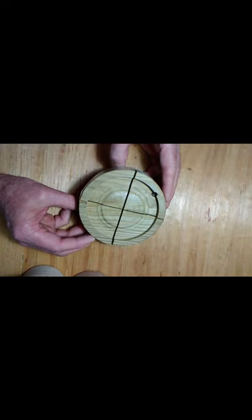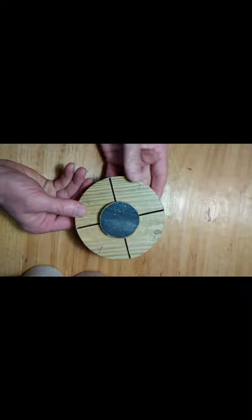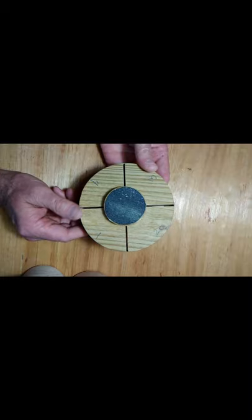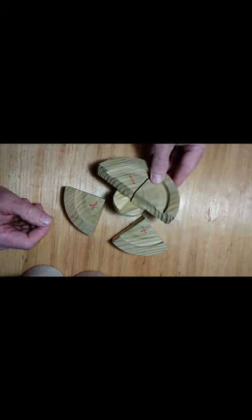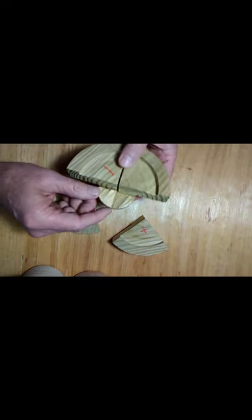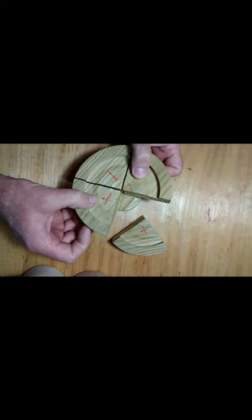The one I used during the filming was made out of a 2x6. And here the grain is running in this direction. I didn't think much about this, but when I turned the first mug, I tightened it down and I heard a pop. And this is what happened. I broke 2 of these quadrants off. Not across here where I'm accustomed to having it break, but it split in this direction. That means the only thing holding this on was the strapping tape.